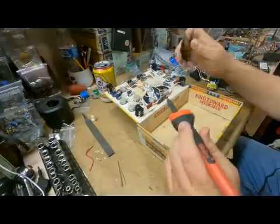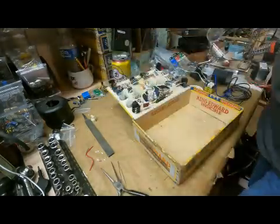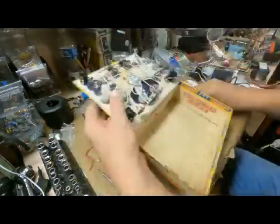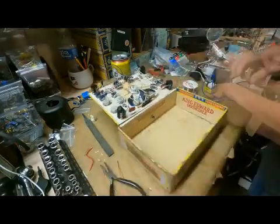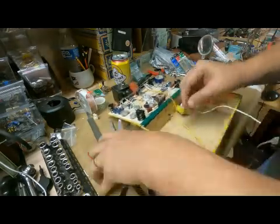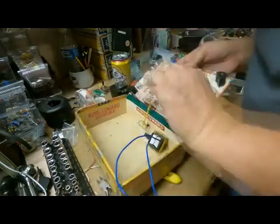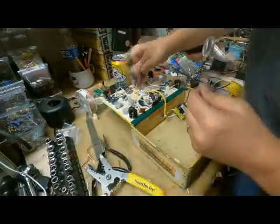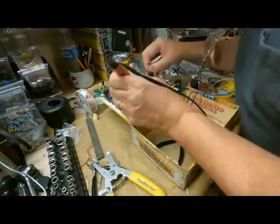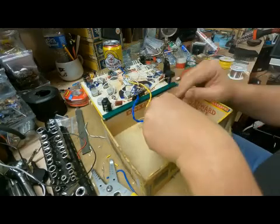Alright, let's go to time lapse and watch this happen lickety split. Got to clean off those resistors there on the tags. Definitely want to drill a hole for the power input. That needs to be wired up directly to pins 4 and 5 of the 12AX7, and then it needs to go back out through the other transformer, run in reverse to get 12 volts AC back to 120 volts AC, and from there I can run it through a full wave rectifier, through a couple of filtering capacitors, and ultimately power up the tubes by connecting it to those resistors on the tag board.